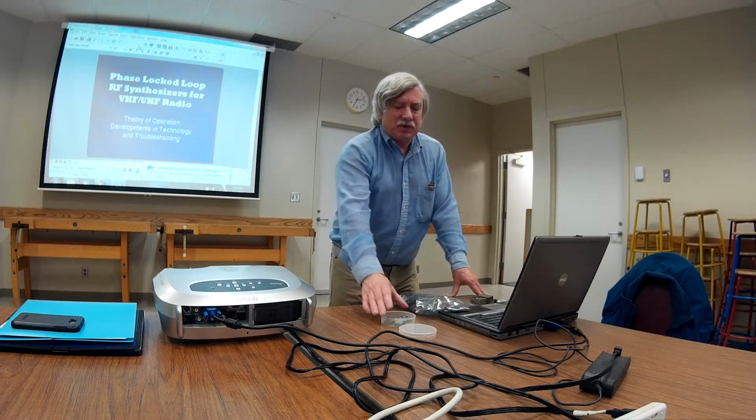For phase lock loops, again, the common problems are: reference oscillator is dead, VCO is out of range, and microphonics. Don't let this happen to you. And if it does, hopefully I've given you some help in how to be able to fix them. Okay, that's it. Any other questions?